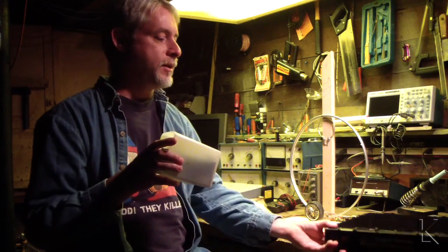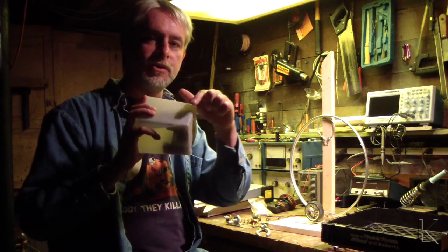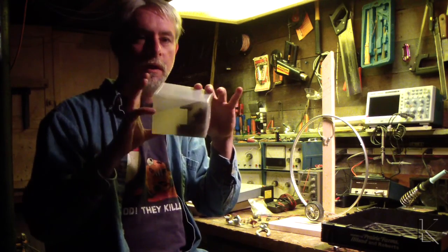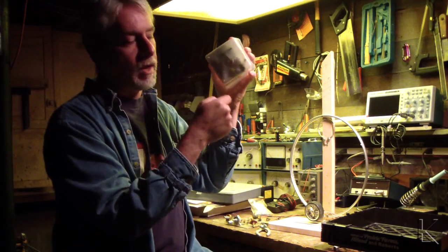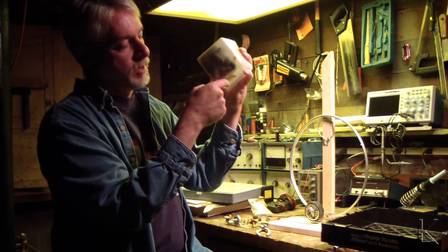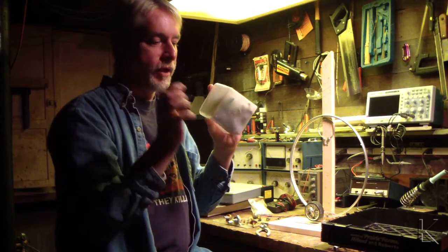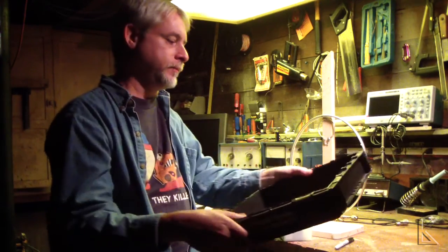And what I'll do to match this is I'll cut four or five slots on each corner of this and wind four turns. They won't actually be full turns though. At one corner they'll come down here and they'll stop, and I'll tap through screws and join those all up. So it'll be like a band. It'll just be a wide conductive area that matches the width of this. So the wires will be lined up with each other across the form, and it'll couple to that bigger loop more efficiently.